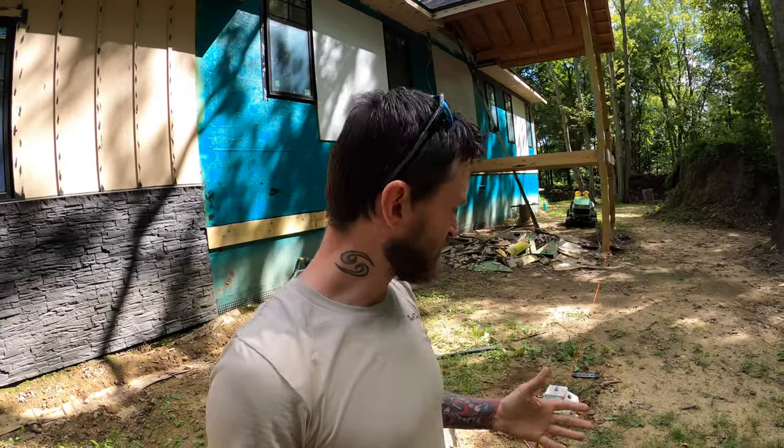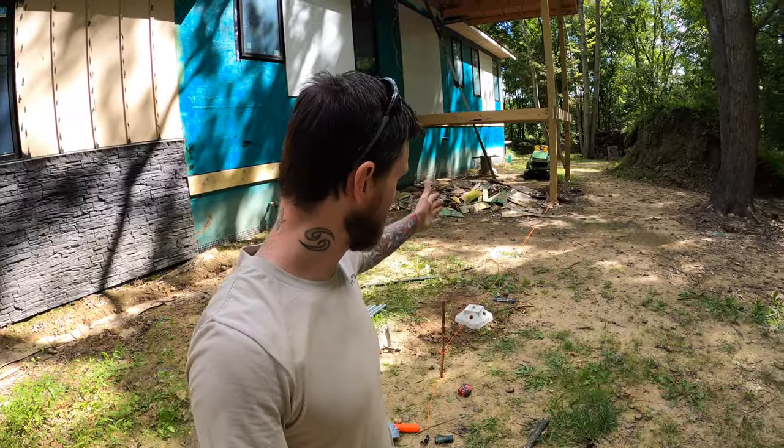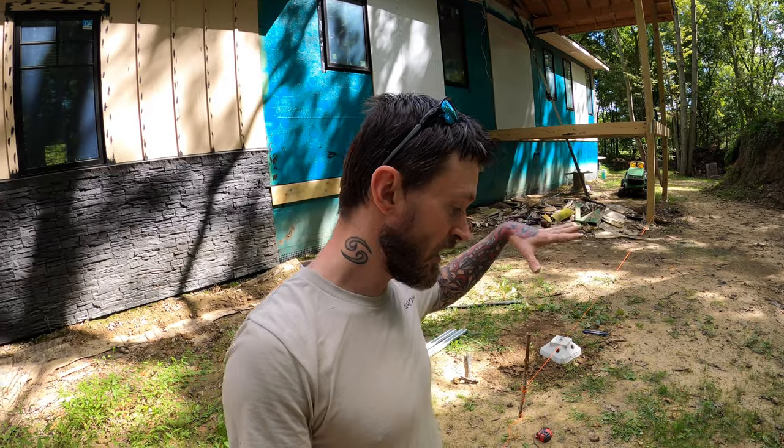The reason why you may end up spending more money on the diamond piers, but you end up saving on your own back-breaking work and labor, is because if we wanted this deck to be holding up 6,600 pounds with over 3,000 pounds of load capacity each, I probably would have had to dig a big enough hole that I would have needed to rent a skid steer with an auger bit to go down below the frost line around here. I think it's 32 inches, or maybe it's 38, but we would have had to dig down like 40 some inches.